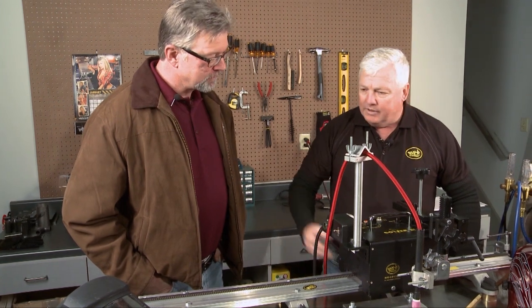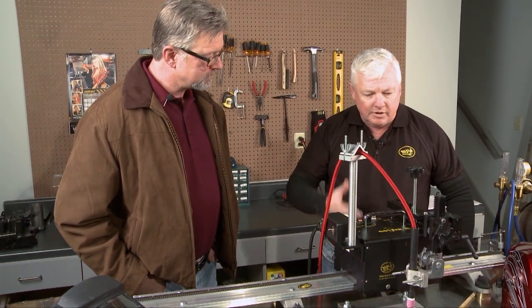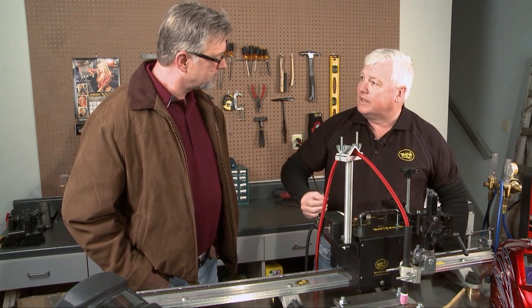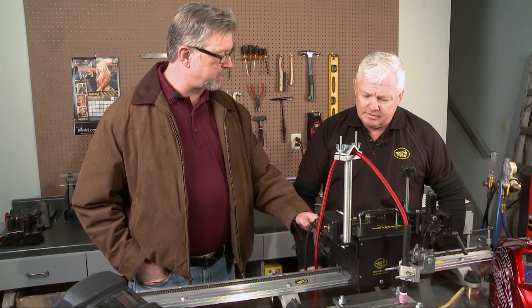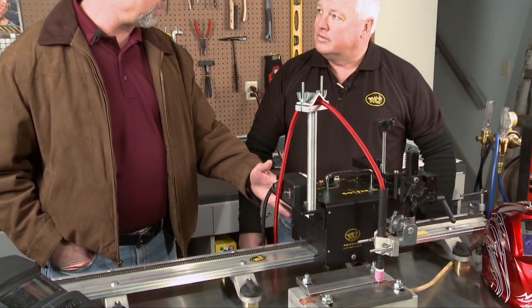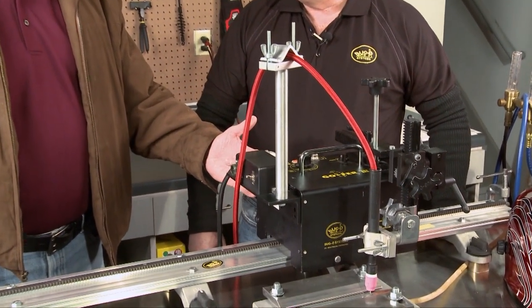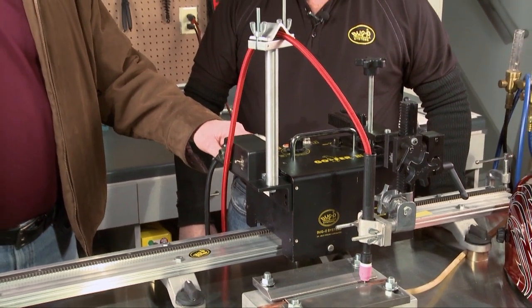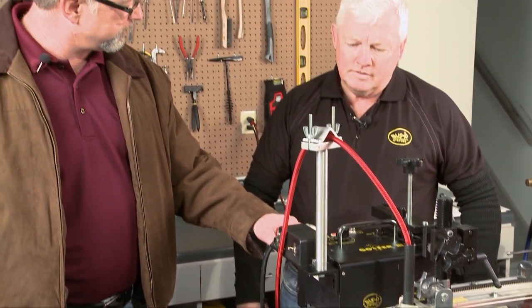I'm setting up to run some stainless steel here. I've got a little backup gas coming through this tool, and I've put this whole package together. My understanding is that this whole package is just a little bit over $7,000. When you take this and incorporate a Gopher — which is a very inexpensive piece of equipment that is very reliable and very repeatable — it makes it cost-effective to take a torch out of a welder's hand and put it into our piece of equipment. This is not being done in too many places that I know of, and we feel it would be very advantageous for anybody doing TIG welding.